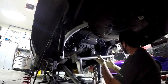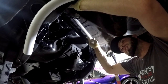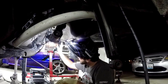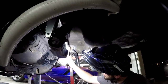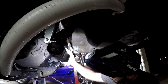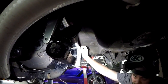It's the driver and passenger sides. We're looking to bring this as high as it can go and as forward as it can go — usually that means it's almost touching the upper torque box plate. We'll get this clamped into place and start doing some tack welds. We have it all the way up and all the way forward. Using this bolt as a reference from side to side gives you an idea of where you need to be. Measuring from the center of the bar to the bolt head, I'm coming out with about two and a half inches.